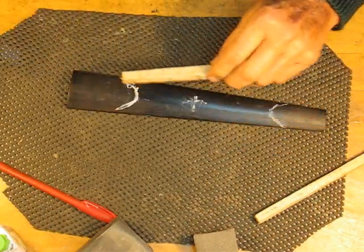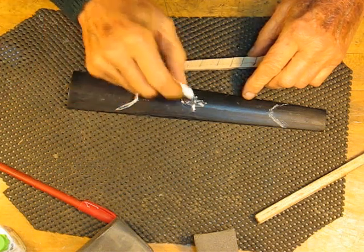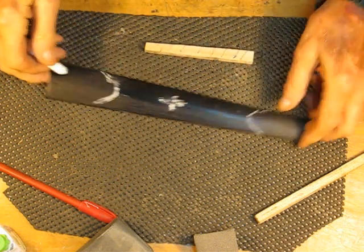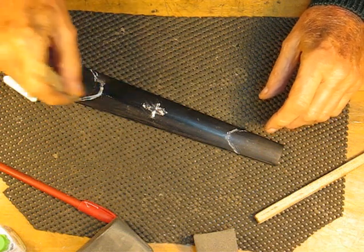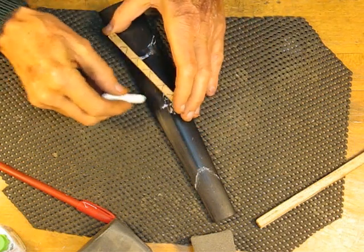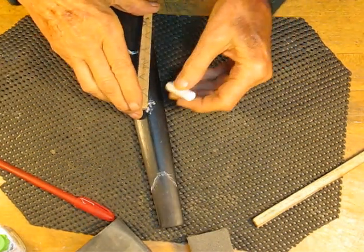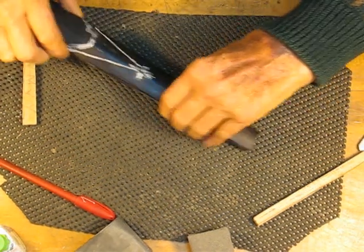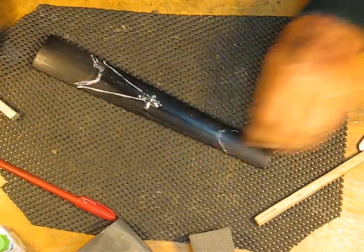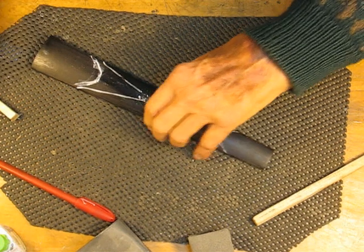So you tune from the acoustical center outward, which means this whole area is low. Let's see how consistent it is. Pretty consistent. We're going to do that by drawing a line there. This is the area of material we're going to remove to raise this up consistently. We want to consistently remove material from this area, and don't touch or go over this mode 5 line at all.